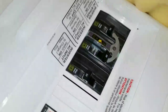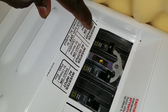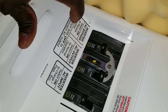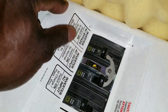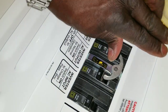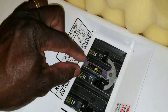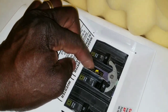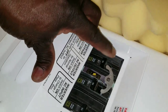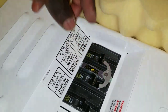Here is the bypass — that's for the inverter. It's the AC inverter bypass. So you switch on to bypass the inverter if you want to, maybe if you decide to charge your battery and the batteries are low. You can do the bypass and it goes either one way or the other — they will never both be in the on position at the same time. As a safety mechanism, this swivel thing is here so you can go either/or, but they will never go all the way together simultaneously.